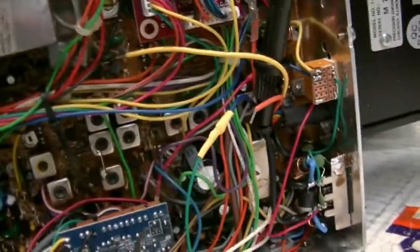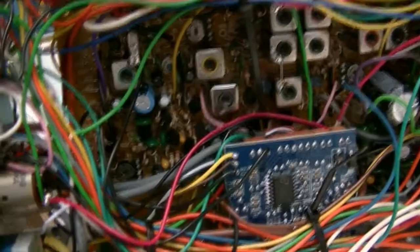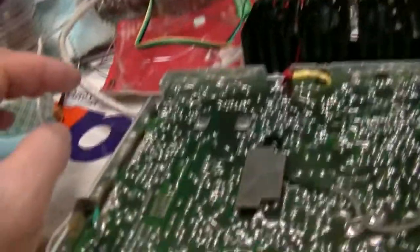There's the control wire that comes from the front panel right there. When you push the amp switch on, it puts 5 volts on that pin, and this pin here has ground connected to it — connected to the ground side of the power jack. So when you push in that switch, it activates the relay and puts 12 volts on the fans. So as long as your amp's running, your fans are running. There's where your echo board is mounted. The inside of this radio is full. There's your new 4-pin jack — the LC5304. I replaced this transistor with a 5-watt power transistor; this controls the current for the transistors when you're in AM. I did the broadband on the receiver and broadband on the transmit. Got your 10-turn installed. Repaired your noise blanker.